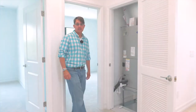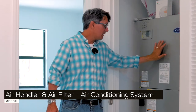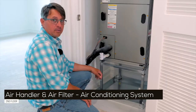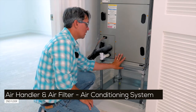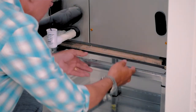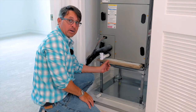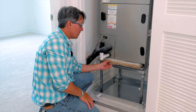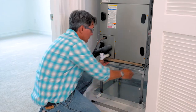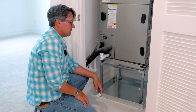The air handler for your AC system is going to be on the second floor. Your air handler houses your air filter, which you will want to change on a very regular basis. The air filter is right here — you will pull these two tabs back, remove the cover, and pull the air filter out. This should be changed on a very regular basis. I do mine once a month — it is a small cost to help keep a large cost running properly. Once you put the new one in, put the cover back on, snap it into place, and it is good to go.